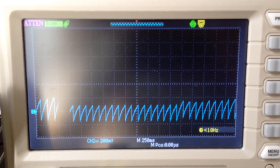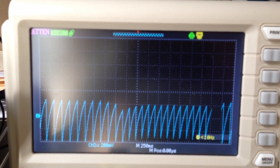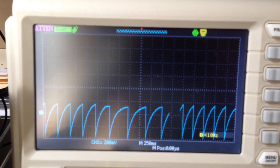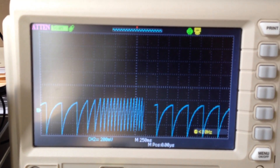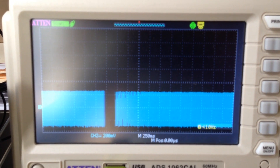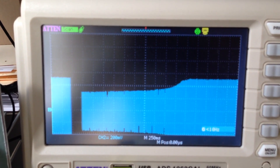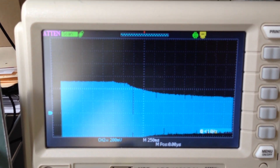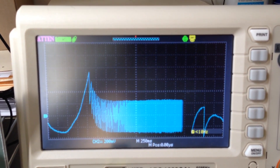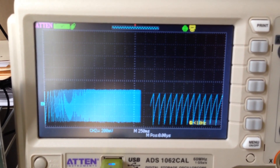That's a low frequency output of the VCO. Let's turn up the volume so you can hear it — you can see the wave amplitude getting bigger. It's at about max volume. You lower the frequency, and then raise the frequency. Above audible range. And that's the VCO — it's the oscillating voltage that drives the speaker.